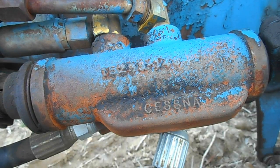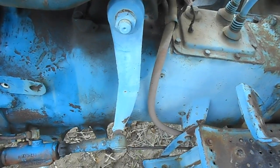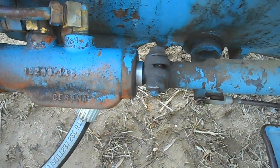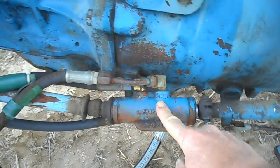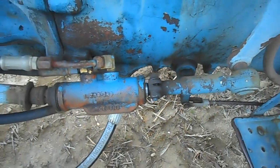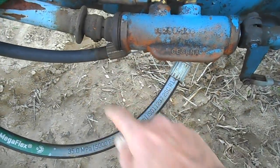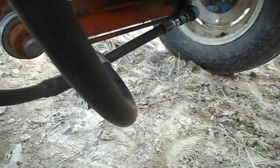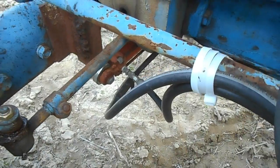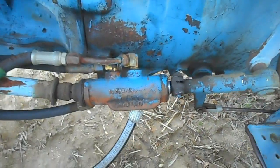And that word below it is CESSNA. Up here at the steering wheel, when you turn the steering wheel, you'll see that move. And when that moves, you'll see that right there go in and come out. That's the actual control to this valve, which sends hydraulic fluid coming off the high pressure side of the pump, down here into the control. It sends that fluid depending on which way that moves — whichever way is which way you get fluid through this line or that line. They go down, and that's just a regular old lift cylinder that I got welded and rigged up in there. Depending on which way you're putting fluid in it, it'll either open or close. The rest of this is just rods, mechanics, nuts and bolts. So that's the gist of the operation.